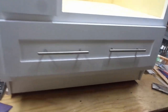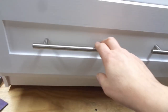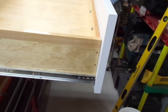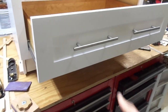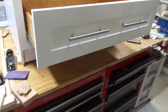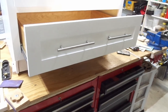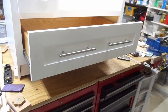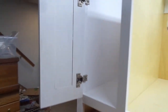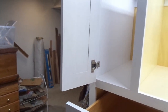Here is the cabinet finished. Down here is the toe kick drawer — it opens up and you can see the dowel plugs for reinforcement. This drawer uses tongue and groove joints and is solid maple. This piece is MDF — I used MDF for two reasons: it's glued all the way around and MDF takes glue very well, and you can get MDF in quarter-inch thick pieces, which my dado stack goes to, making it a particularly easy joint.